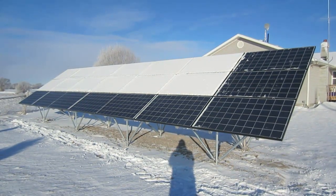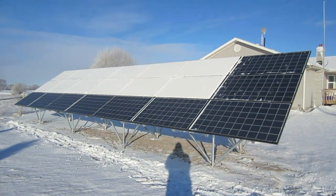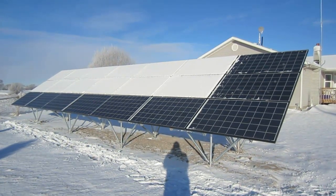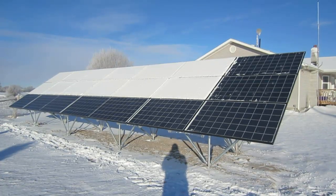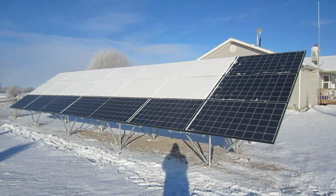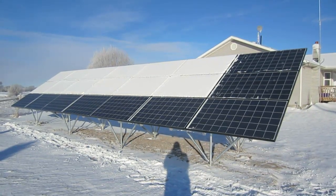I went back into the house, and I'm generating 400 watts of power. So if you have solar panels and they're set up in series, you want to make sure that you have all three panels uncovered. It'll be the same situation if you have three panels set up in series and you have a tree shading the bottom panel, the bottom two panels, or the top two panels.